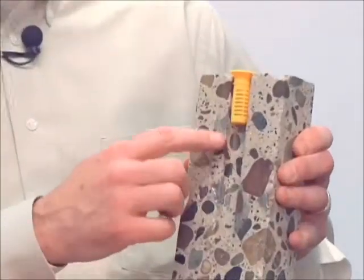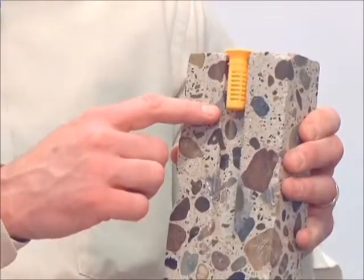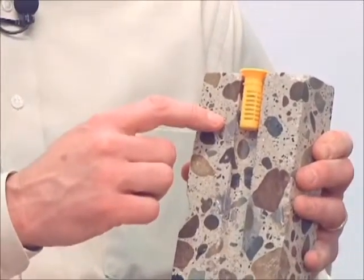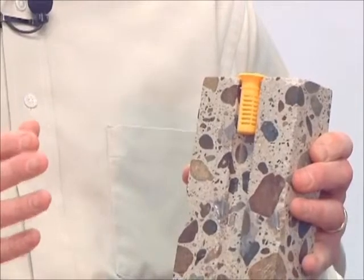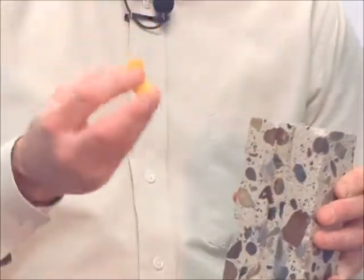Often these sleeves cannot read exactly at the important equivalent depth. For example, this first sleeve has horizontal cutouts along almost the full length. That's a real problem — we want to read at a specific depth in the slab, but we can't do that because we're reading at different levels in the concrete. This gives a low, watered-down reading, often significantly low, underestimating the true relative humidity at equivalent depth. There's no way to get a correct reading with this type of sleeve — it's a very flawed design.